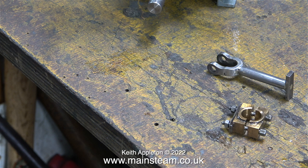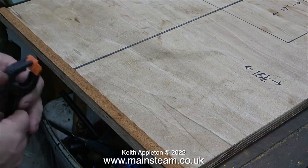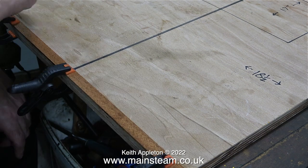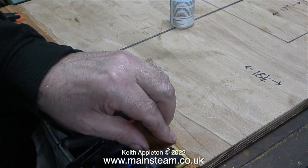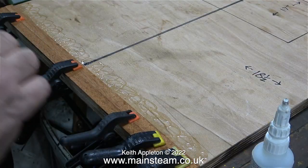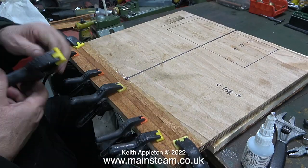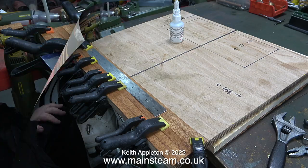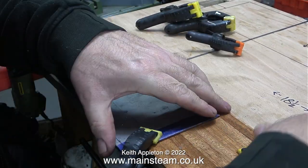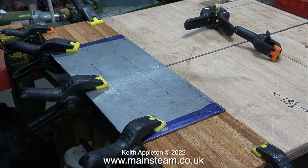At the moment on this engine the crankshaft is not in the correct position. What I'm doing at the moment is planking a baseboard — this is not part of this series at all; it's part of a series called Building a Stuart Model Steam Plant. I've already done this once but the baseboard warped so it was scrap. The piece of wood I'm planking is 9-ply 18mm plywood, and I don't think this baseboard is going to warp at all. I'm using mahogany planking with cyanoacrylate adhesive, also known as super glue or CA glue, and this is the medium viscosity variant. This piece of steel is the boiler mounting plate, and I'm using it as an extension to the spring clamps to hold the mahogany planking in place.